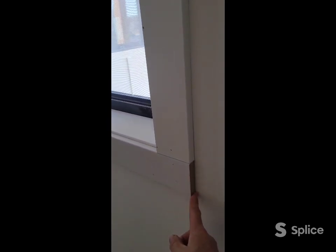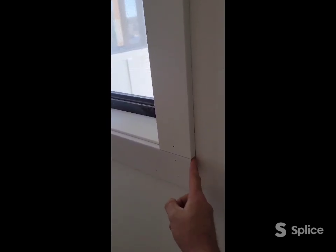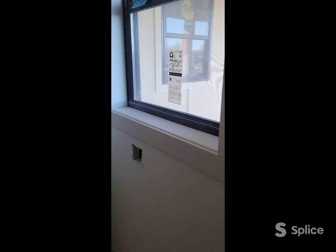What I do is take some 80 grit that I've used on my orbital sander — after it's kind of worn down a little bit, I'll take that off, fold it up, stick it in my bag, and use it to sand up. Even fresh 80 grit will work too. Just smooth it up and get it to where it basically closes up everything on the MDF so that when the paint goes on, it sticks better and bonds better. Obviously they're still going to prime, so they'll get a good bond with the prime and then paint up. I do that on all my raw cuts, even on the headers — I sand all those.